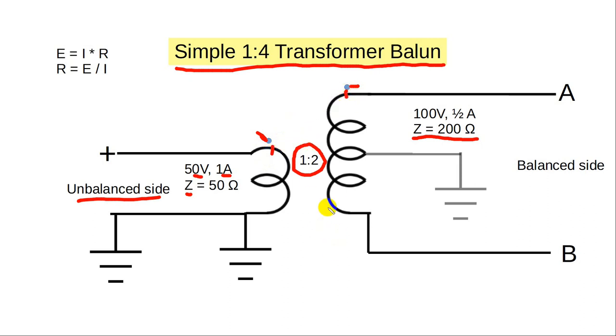This positive and up here they go together, so there's going to be 100 volts here. To keep the same amount of power, this will be a half amp, so 100 divided by a half is 200 — this is 200 ohms over here. The impedance goes up by a factor of four, whereas the voltage only goes up by a factor of two: voltage up by two, current down by two, and the ratio changes to 200 ohms.